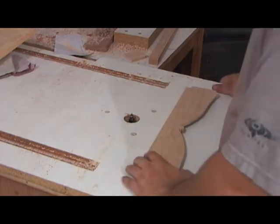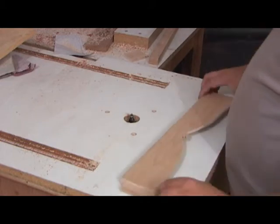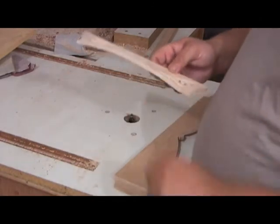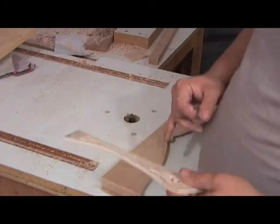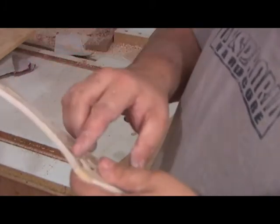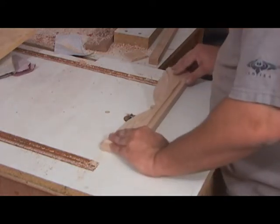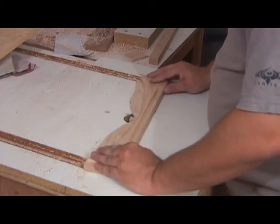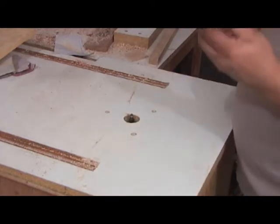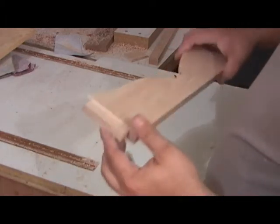The bed is still set up in here from when I routed the legs Thursday night. I need to put the same round-over here as well as give my reach right here. This scares me because it's so thin that I'm afraid to go against the grain, so I'm actually going to go the wrong way and very carefully. Slight curve, not too bad — a little bit of grace to it. I didn't want it to be too sharp.